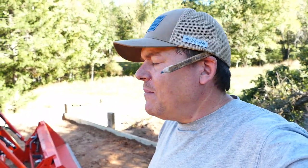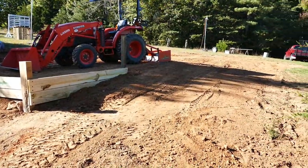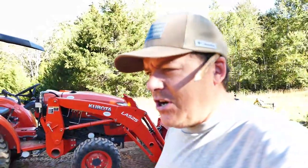The other section over here, the actual retaining wall that we built, I gotta come through here with a saw and I'm gonna knock those posts level with the timbers. But this is all, I think, gonna work out pretty well. It looks good and strong, and the RV that we're gonna bring in here should fit just fine. And this grade that I've already set up is close enough to level that I know we'll be able to get the RV sitting nice and straight up here, even without the gravel. But we can do a final grade and get even more precise once we bring in the gravel. And I'm gonna save that for the next video.